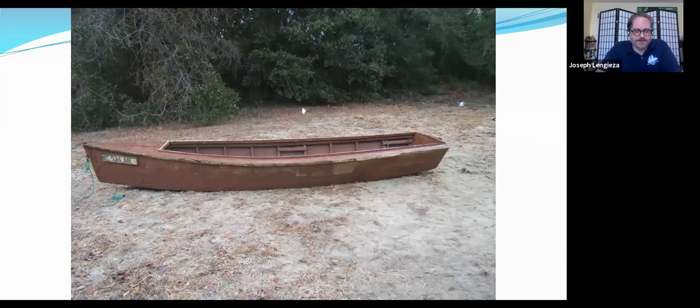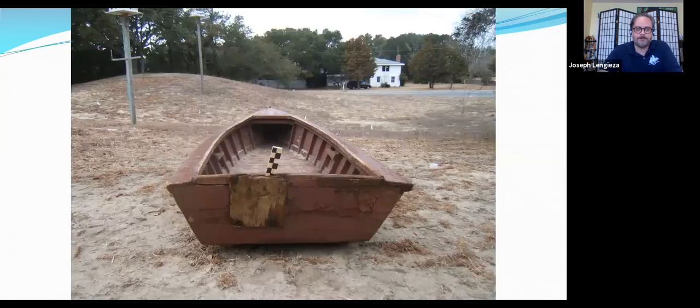So if you look at these skiffs, you can tell they're pretty flat. There's just a tiny bit of arc to the bottom of the craft, a little more on top. And this is a very late example of shell first construction. And we'll talk about how to build one of these. Square transom. Again, it's meant for one person, sometimes two or three, but typically one. And you'll want a fatter section of boat aft to accommodate that weight. And also you can see an outboard engine was mounted on here at some point. That's what that plywood patch is.